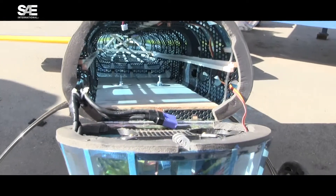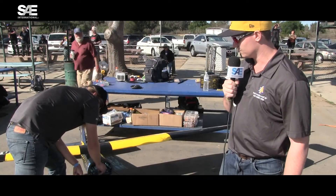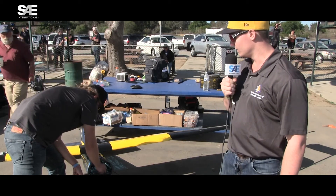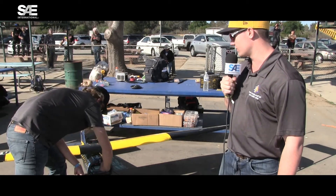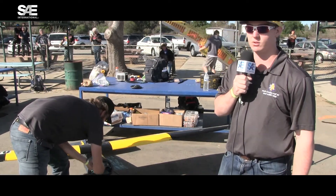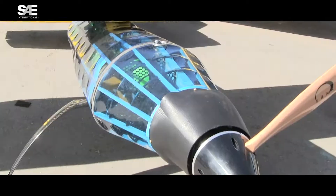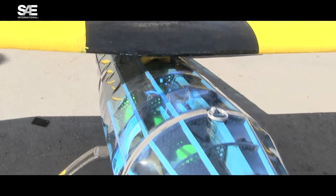You can see all the way down the fuselage structure — it's lightweight ABS with honeycomb. We designed it by starting from different shapes of the fuselage and lofting it in SOLIDWORKS, resulting in a continuous flow, high aerodynamic efficiency design.